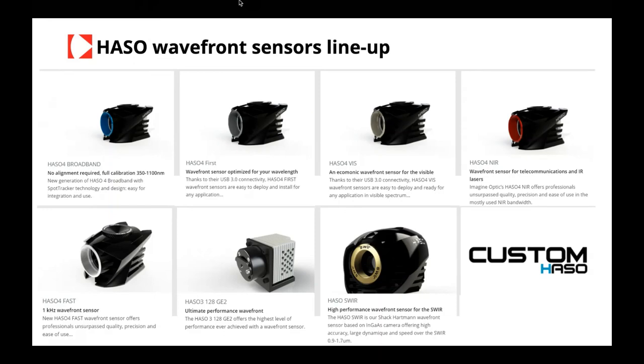For sure, the Shack-Hartmann wavefront sensor has many advantages compared to the lateral shearing interferometer. First of all, as you have seen, it's completely achromatic. The spatial resolution doesn't depend on the wavelength. You don't need to design any mask in order to get the wavefront. Everything is automatic, including the detection of the pupil. And finally, in terms of resolution, sensitivity and accuracy in phase, all the measurement comparisons with shearing interferometers show superior results from our technology, the Shack-Hartmann technology integrated by ourselves.